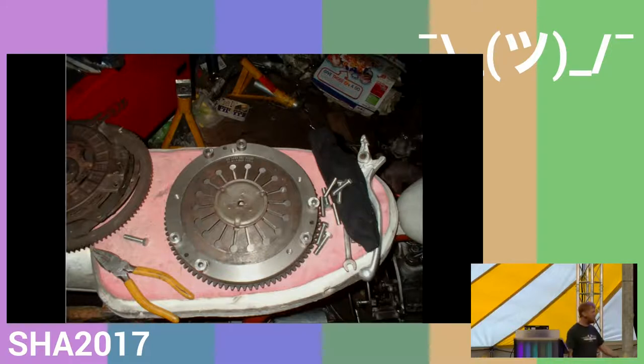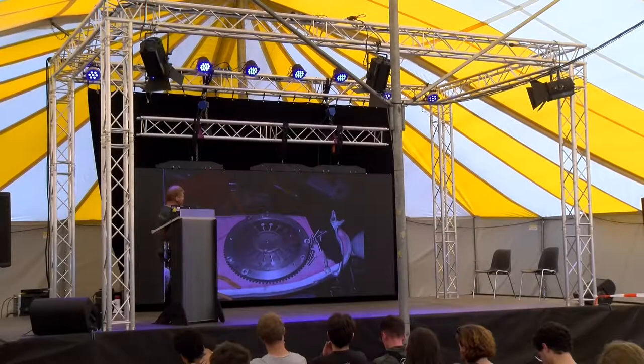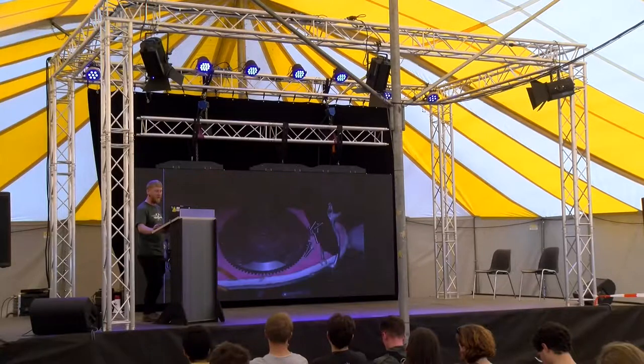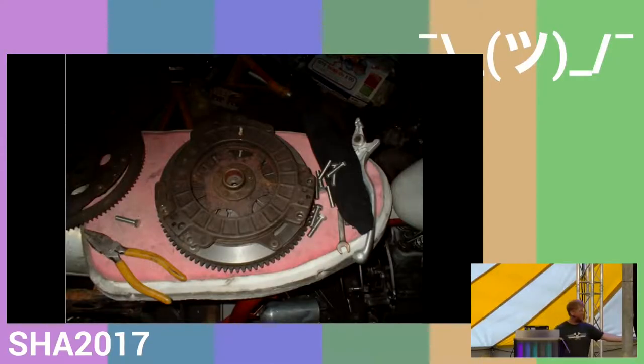If you're not aware, the diaphragm spring, the washer spring that's in the center of a single plate clutch like this, has a very narrow movement of operation. So the depths and distances that they had to be turned down to on the lathe had to be really quite accurate. And I managed it, and there it is with the clutch of the gearbox mated to the flywheel.